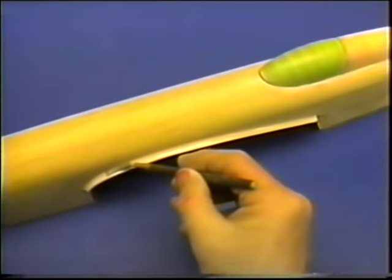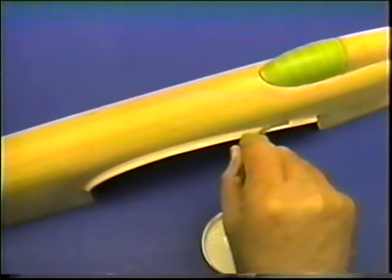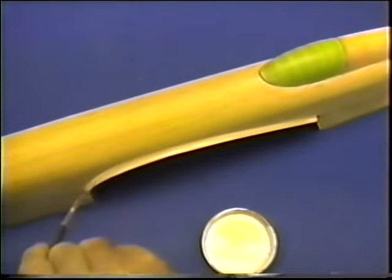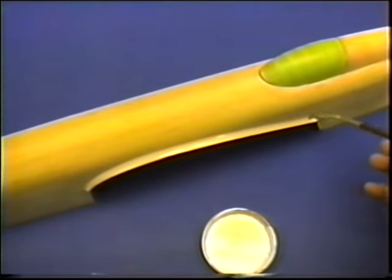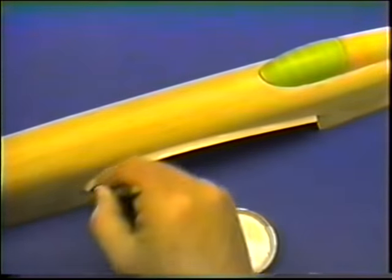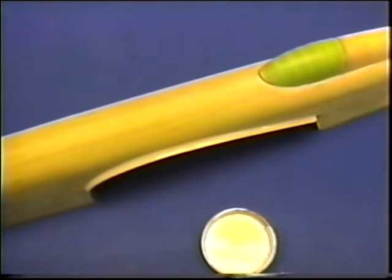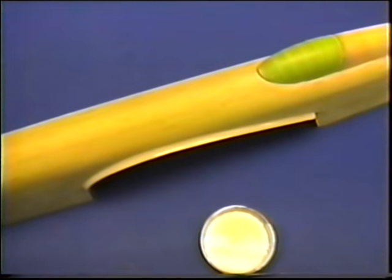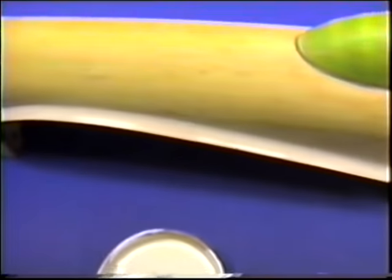Yeah, with retarder, you have plenty of time if you want to go back and forth over it like this. It's really not a problem. But as you build coats up on the second or third coat, you want to try to get it on all at once, or just spray it. You could back mask a little bit here and just airbrush these in if you wanted to. And as we lay the second and third coat on here, boy, it really starts to look nice.